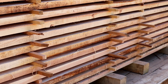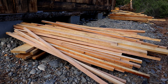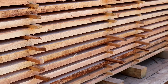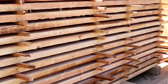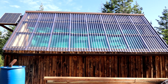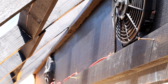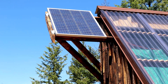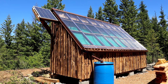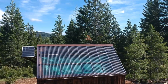As we're stacking this lumber, we're using what are called stickers — basically just little pieces of wood that we've milled into three-quarter-inch-tall lengths. They go in between all the rows of boards as we're putting them in the kiln, giving enough space for air to flow through and help the drying process. The solar kiln runs on two main principles: one is heat, provided by the sun through the roof like a greenhouse; and the second is airflow. We have two fans up in the baffle, run off the solar panel — no thermostat, no switch. Those fans start the second the sun hits the solar panel. Airflow really helps with the drying process.